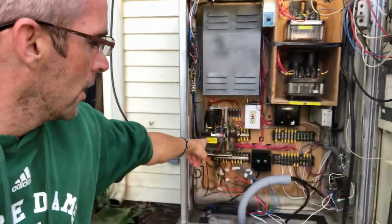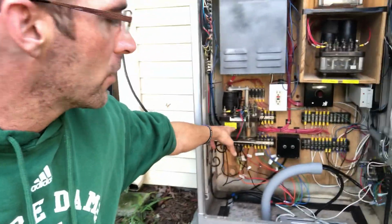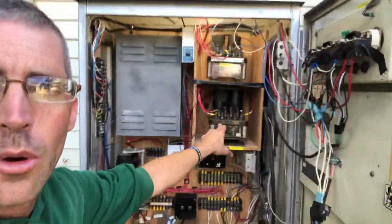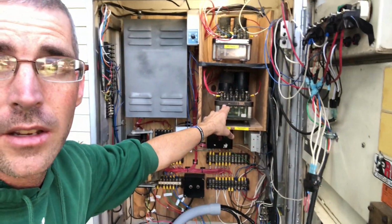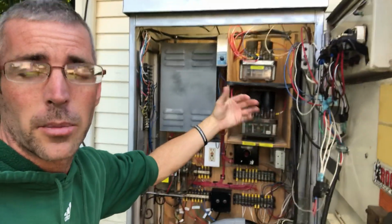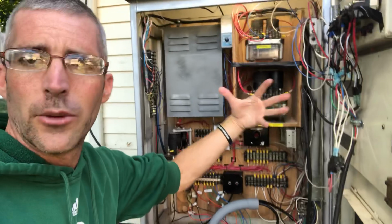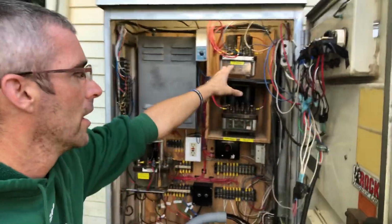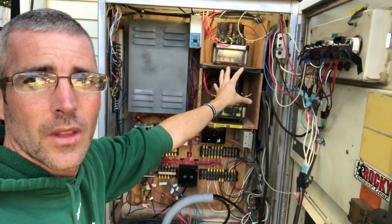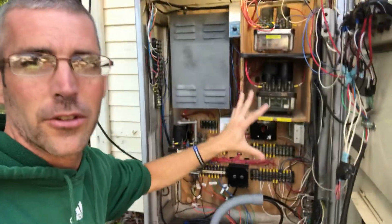I've got the flasher relay, the FN16 relay. I've got the DN19 slow drop away relay right here that, if you haven't seen the other videos, as soon as power is disconnected from that, that's what causes the gate to drop. There's a few second delay. And then I've got my XR relay, which is the flasher, the main relay that kind of functions everything, that kind of triggers everything off.